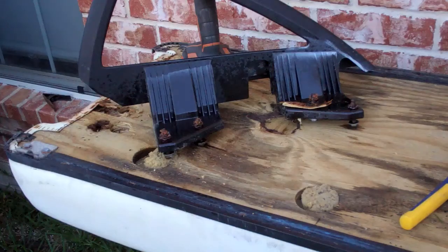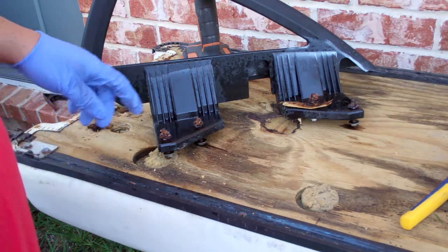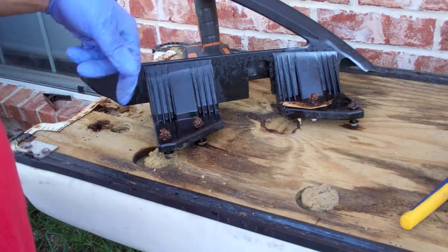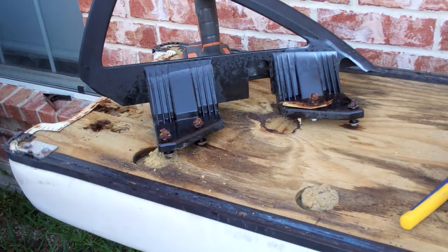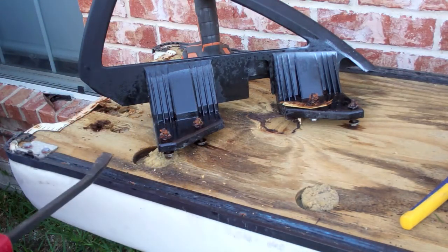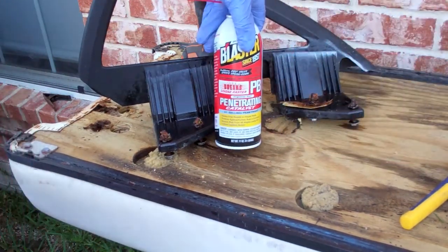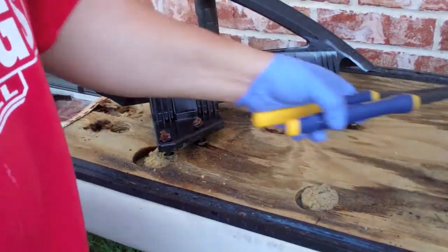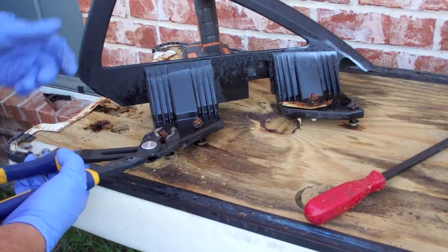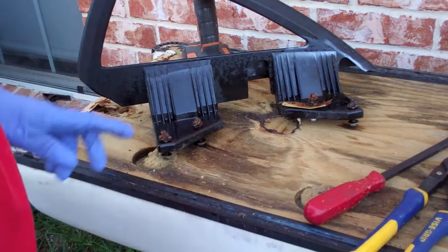This side was much less cooperative. All four of them were so rusted they're basically welded together, and the nut that's inside the wood was just spinning around like a drill bit. I had to basically pry them out with a pry bar while running the power wrench on them — not an ideal way to get them out, but that was the only way given their condition. I got them soaking with some PB Blaster penetrating oil, and after they've soaked a while I'll hold the nut with vice grips and use a hand tool or drill to turn the bolt on the other side, hopefully getting them to loosen up.